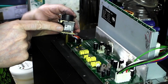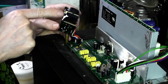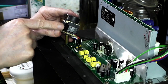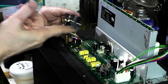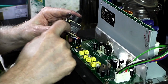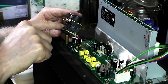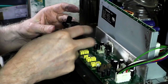I managed, after several hours, to get it out — not without causing some damage though. I'll turn this around so you can see: where I wasn't able to get it back together all the way — I actually had to unsolder all these and remove the whole jack, then take the jack apart to get the little piece out. When I was putting it back together you can see it works great, but it's not all the way together, and I think that might be part of our problem because air can actually get through here. When I took this apart the first time they had electrical tape around it and I couldn't figure out why — now I know.